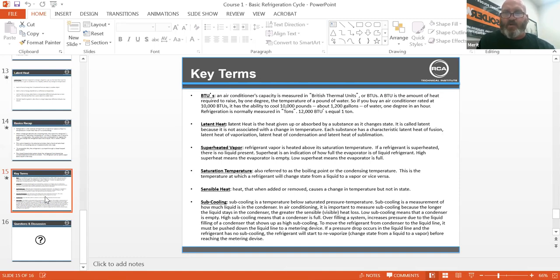If you've ever been around a boiler — superheated steam actually has no visibility, you can't see it, it's clear. We used to check in boiler plants with a wooden stick. If there was a superheated steam leak, it would cut the wooden stick in half and you wouldn't even see it. Crazy stuff.